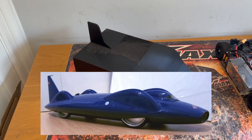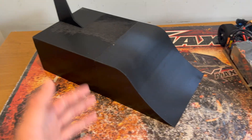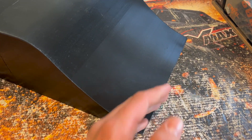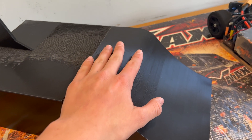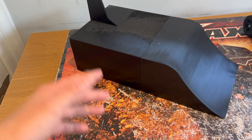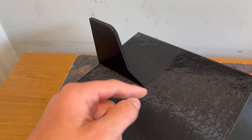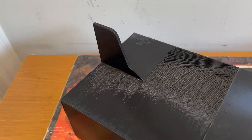As you can see, it's got fully enclosed wheels — the wheels will be sitting inside the car, which should keep it nice and streamlined. There's a nice big sloping front body that fits smoothly on top of the splitter, giving minimal drag. This part here should give us a nice bit of downforce — we need a little downforce on this project because it's so light, but not so much that it stops the car from driving. And we've got a singular fin on the back, just like on Donald Campbell's car, to help keep the car going in a straight line rather than to create extra downforce.